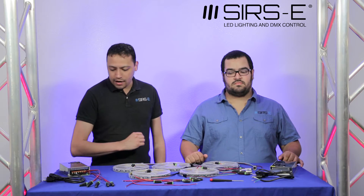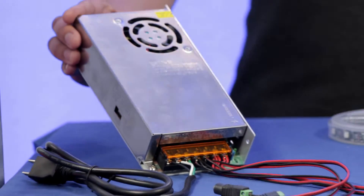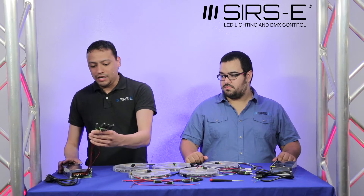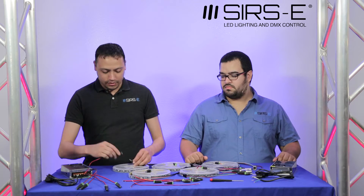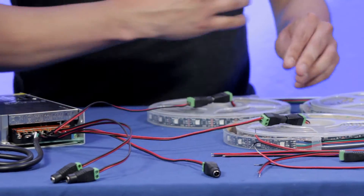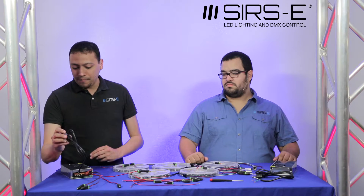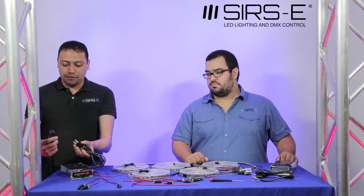What we have here right now is one that's already pre-connected. This is a 12-volt, 200-watt power supply. We've got five leads already set up — each of these leads will be connected to the end of your DMX strips, like this one here and so on for all remaining strips. The next component is your AC power, which will simply plug into whatever your power source will be.